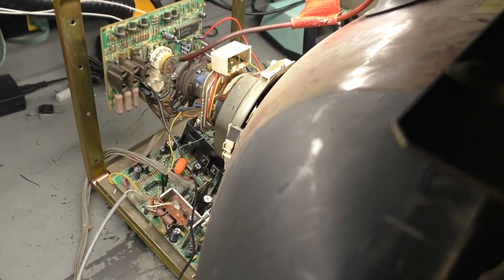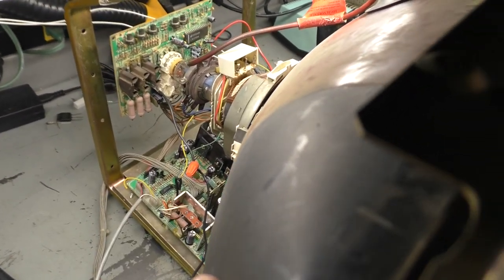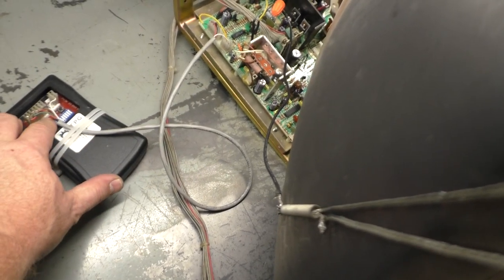All right, we are all hooked up on a dedicated U5000 tube and yoke so we can do all of our proper testing. I have anode, neck, yoke, ground, power, video, remote all hooked up, so we're not going to damage anything by leaving something unhooked. Got the test pattern generator hooked up. We are set to standard res. I'll go ahead and turn it on.